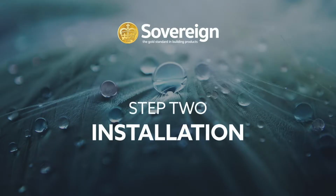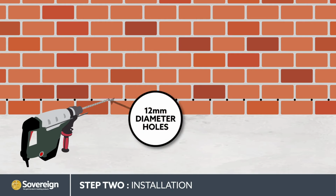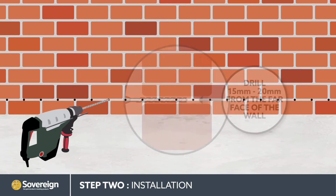Installation. Drill a series of 12mm diameter holes in the chosen mortar course, generally at the base of the perpends and with a maximum spacing of 120mm. Each hole should be drilled to a depth of 15 to 20mm from the far face of the wall.